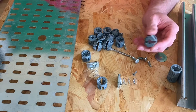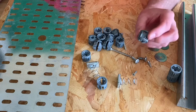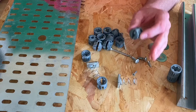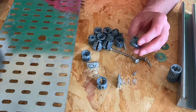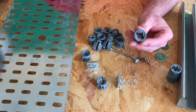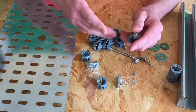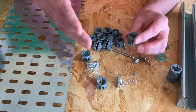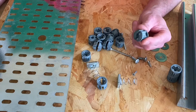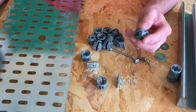The spacers are UV resistant, made from low smoke free of halogen material, and are designed to be attached to the back of either light or medium gauge cable tray. They recommend a minimum of six spacers per cable tray length, however this may increase depending on the size of the cable tray and the weight of the cables you're going to hang on it. These are attached to the back of the cable tray before the fixing process.